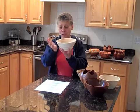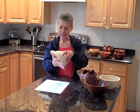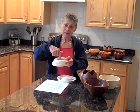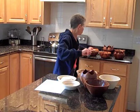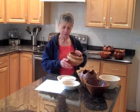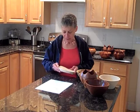The rings do get thicker as you go down, which gives you extra meat for curving in an interesting base, and is used in bowls where you're coming in curving ring on the top, and you want to sand it back so you get a little nicer rim. You don't want a knife edge. You want to have a little meat there for playing around with it, which is what was done on this bowl. This was one thick glued up ring that was cut at two different angles just to give me more meat to play. But this is the easiest way to get a curved bowl. There are more difficult techniques, but if you want something simple for starters, this is the way to go.